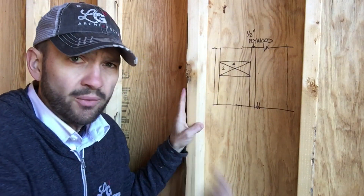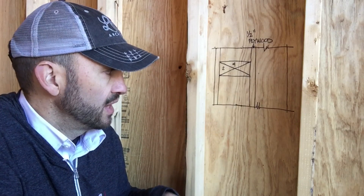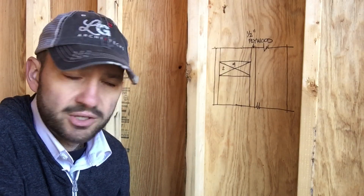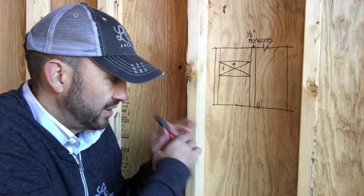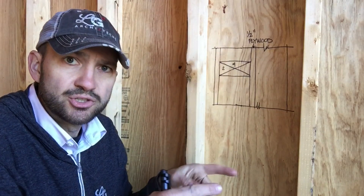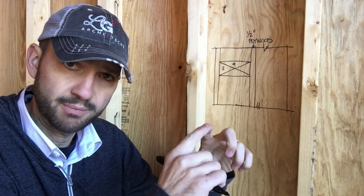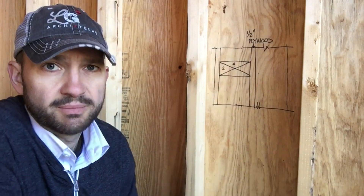Here's how we can get away with it. The cavities are where most homes put the insulation. In our case we've put all of the insulation to the outside, and what this does is allow for the R-value of the insulation to be continuous around the entire structure. So we don't lose any of that R-value from the studs or any other materials inside the cavity. When you have an electrical box or a light switch, all of that reduces the R-value because you take the average or the effective R-value of an assembly. With the insulation to the outside, the only things that reduce the R-value are the windows and any penetrations going through — like a pipe, a ventilation exhaust duct, or something like that.